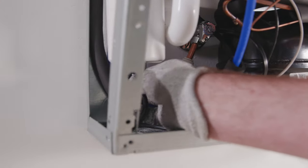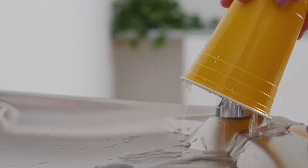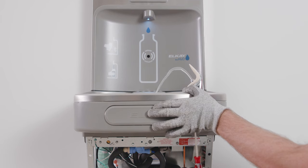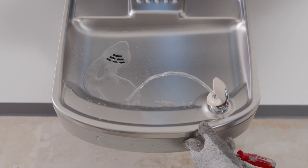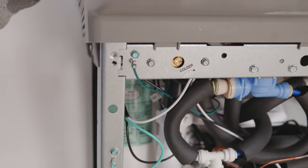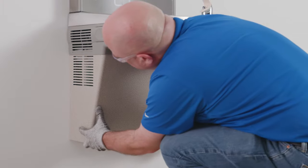Plug the cooler and bottle filling station into the wall. Activate the push bar to start water flowing into the bubbler. Placing a cup over the bubbler will direct the water stream down into the bowl as the water line is cleared of air. The stream height is factory set at 35 pounds per square inch. If your supply pressure isn't 35 PSI, you'll need to adjust the stream. The adjusting screw is on the right side of the unit under the push bar — turn right to raise the stream, turn left to lower it. Ideally, water will hit the basin approximately 165 millimeters or six and a half inches from the bubbler on the downward slope of the basin. If continuous flow occurs at the end of the compressor cycle, turn the cold control one quarter turn to the left. Verify that the bottle filling station is dispensing water correctly by placing a cup in front of the sensor area. Once tested, replace the bottom panel and secure it to the cooler with the four screws you set aside.